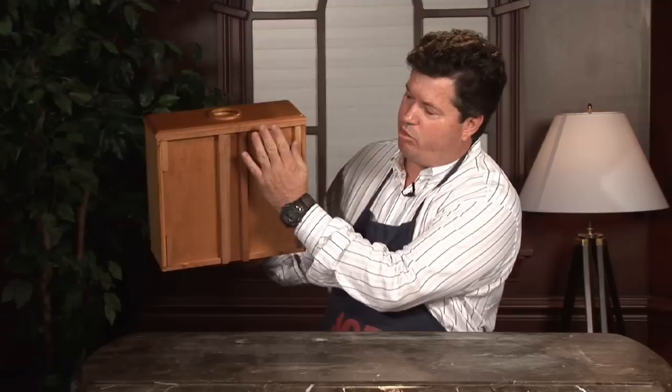You also want to see the nails. If it's got square nail heads on it, that's indicative of the eighteen hundreds where it's an early piece. I also reach underneath the piece and feel it to see if it's what they call hand chamfered — it'll be at an angle where they had to chamfer it into the drawer. This one is not, obviously, because it's from the fifties and sixties.